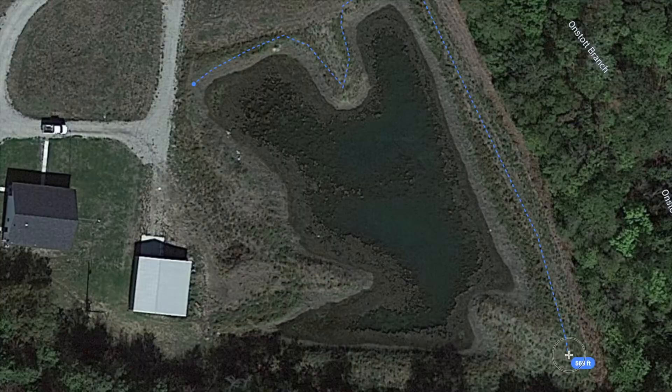The existing drainage area of the pond is about an acre and a half, so every inch of rain puts about 41,000 gallons straight into the pond — but a lot of that soaks into the ground when it's dry. We're about three feet low right now, so it'll take a lot of water to fill back up. By guttering the house and one side of the shop and sending it straight into the pond, I think it'll make a big difference keeping the pond topped off all year. Catching rainfall is pretty easy, but it differs by state — here in Texas we can legally do it, but check your local municipality or county rules. If you can catch rainfall, it's a cheap and free water source; all you have to do is put in the infrastructure to divert it where you want it to go.